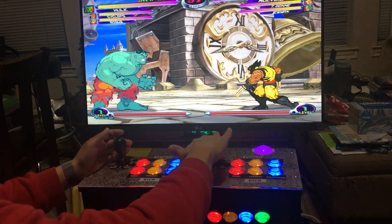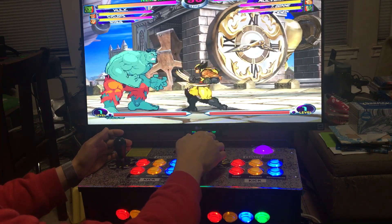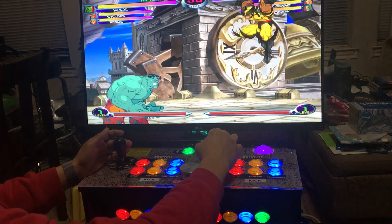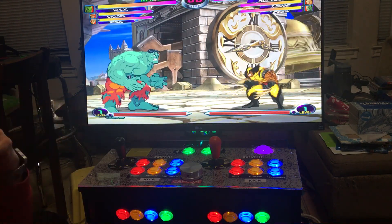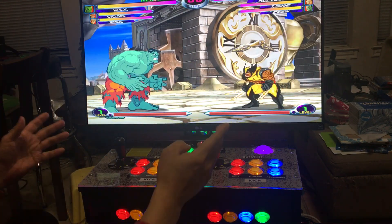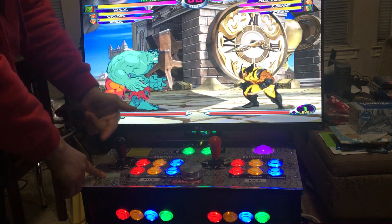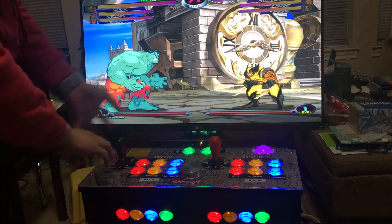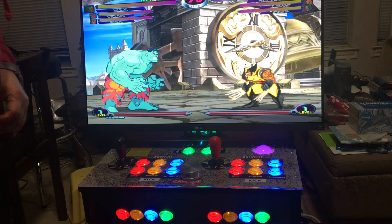Mine is opposite too — right is going down, down is up. I need to take both joysticks and flip them, and that will fix my problem because my joystick is put in incorrectly. The joystick doesn't tell you which side is up and which is down, so I tried to keep the cable away from the joystick side, but I need to flip it the other way so my buttons will work correctly.